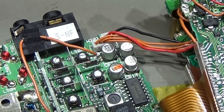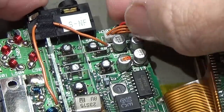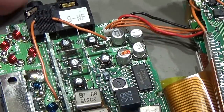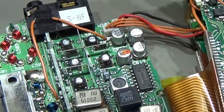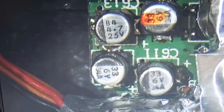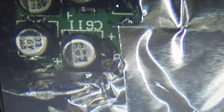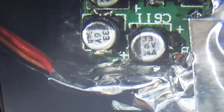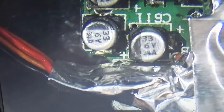That means let's start here on the 70 centimeter board. Let's prepare everything to be able to get down here with a hot iron to really be able to take the broken faulty ones out. Okay, so here you can see the situation under the microscope, and you see that I have covered our area with tape to protect the other components, and of course our connector, which I've covered here.